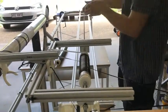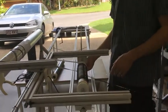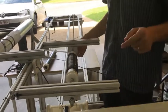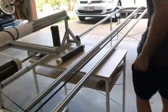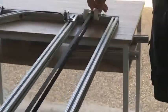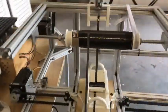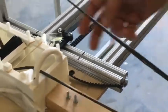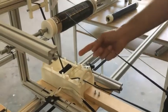Here we have what we call a train. This train moves back and forth along this 3-meter stretch. We use a timing belt which is 6 meters long, and it also has a NEMA 23 stepper motor with a little gear. Over at the far end we have another gear pulley. You'll notice that a lot of these parts are made with white or black material — these are actually 3D printed. We use the 3D printer to make lots of these parts; this particular part took 8 hours to print.